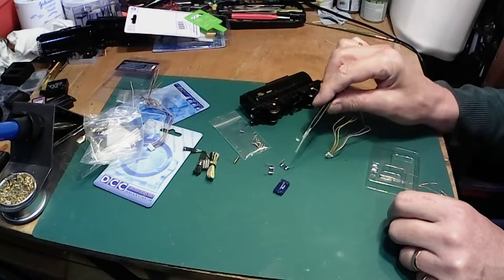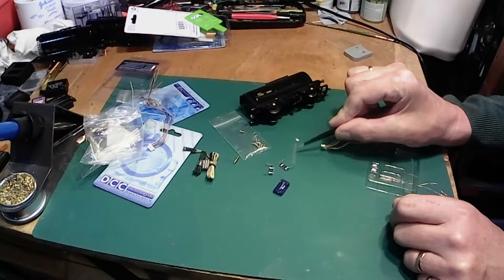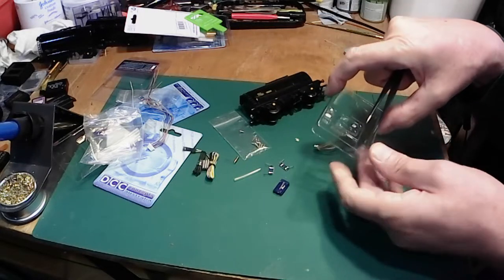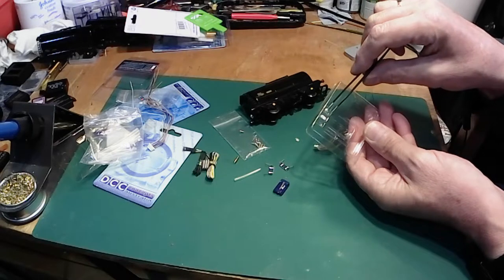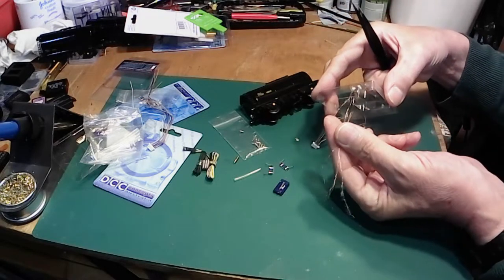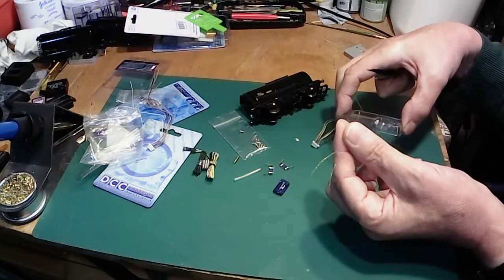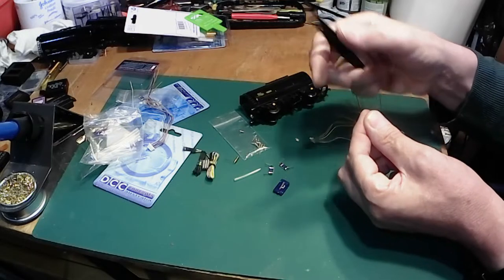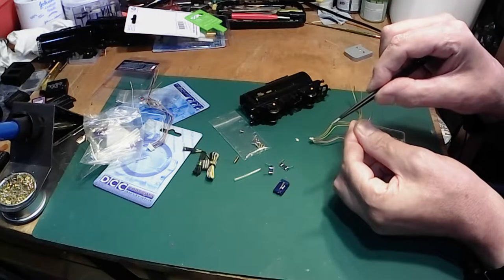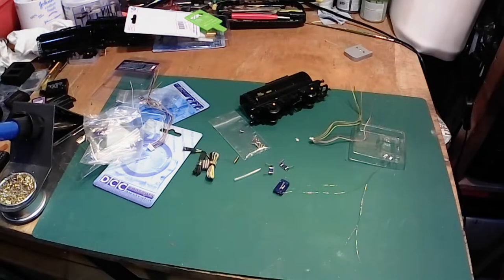I also use their heat shrink. I bought transparent, so you can cut it to size and you can actually see where your join is that you're insulating, so you're not wasting anything. That's quite good, rather than the coloured one. These are, as you can see, the little end of train lamp LEDs, and they're brilliant because they don't bleed. This is the very, very thin wire that comes from behind them. The other thing you've got to make note of is that there is a plus and a minus on these LEDs. The way you work that out, the longest wire is the plus, the shortest wire is the minus. This long wire is important to determine the plus and minus, because you have to solder that to a resistor. Excuse me while I just find the resistor for you.